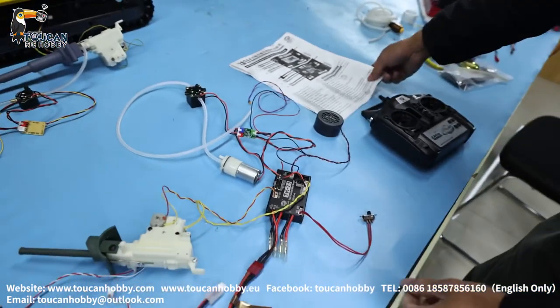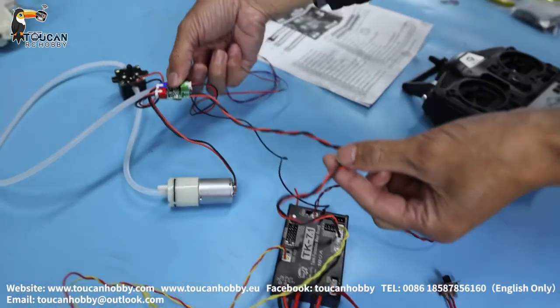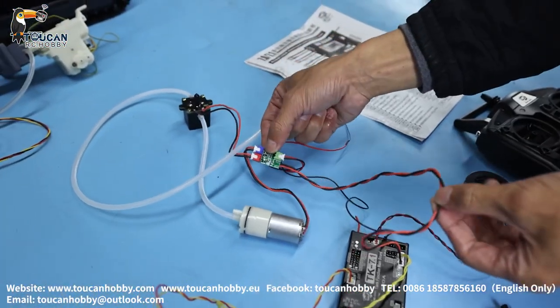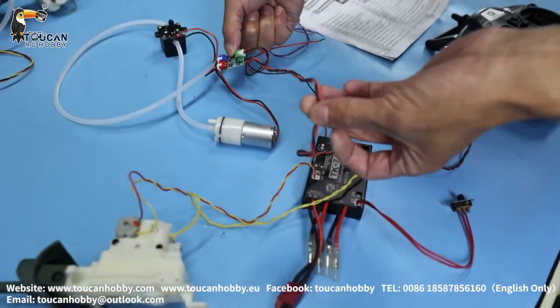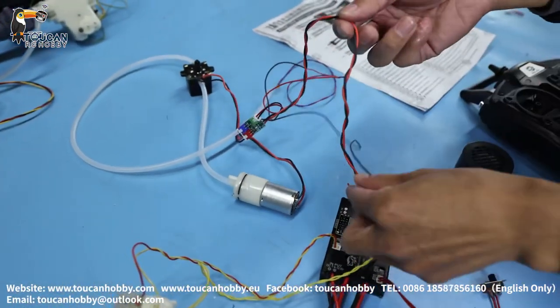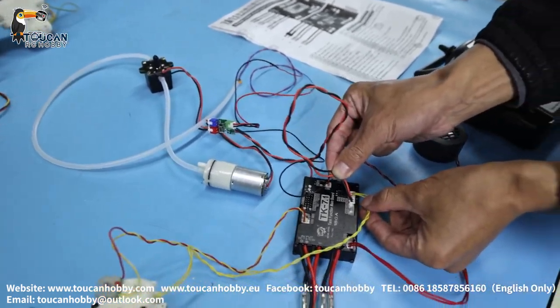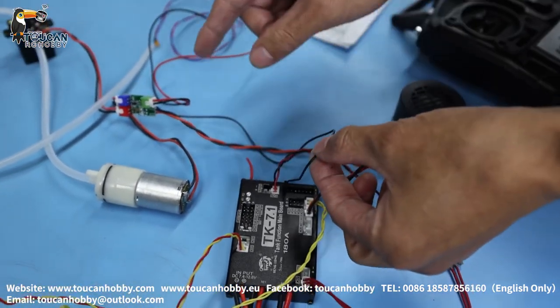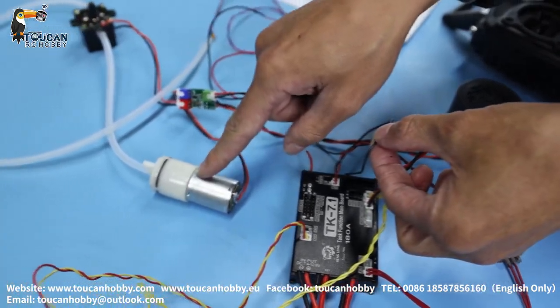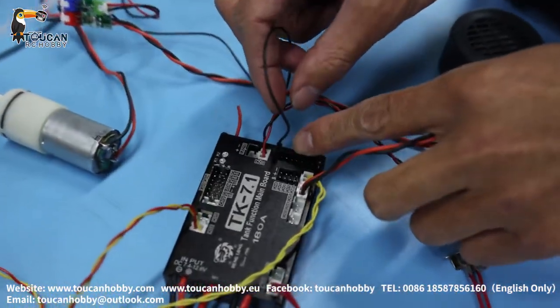So here, let's see how to connect it. This one is a speaker to C9. So here is the board for the firing, smoking, and flashing. Here is the power supply — these two wires. Power supply to main board CN5, CN5 here. And this one is a signal wire for flashing, also for starting the fan to blow air. This is connected to LED1.